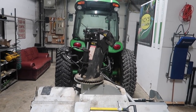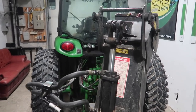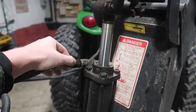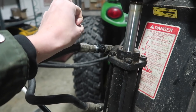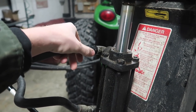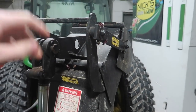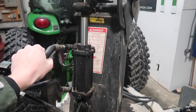Long story short, hope you got a little bit of information out of it. We just actually installed these hydraulic flow limiter fittings — you've got to drill out this piece of steel to a tiny little hole, and that just suppresses how much hydraulic oil gets through there. Because if you just hook this thing up directly, the chute flies like crazy — they go nuts. So you want to slow that down a little bit. Thanks for watching, hope you got a little bit of value out of it and we'll see you in the next one.